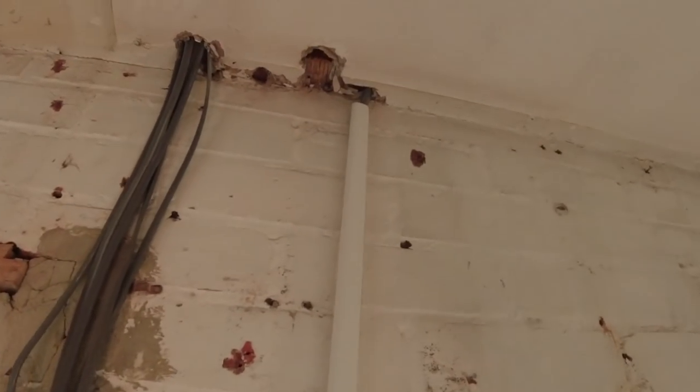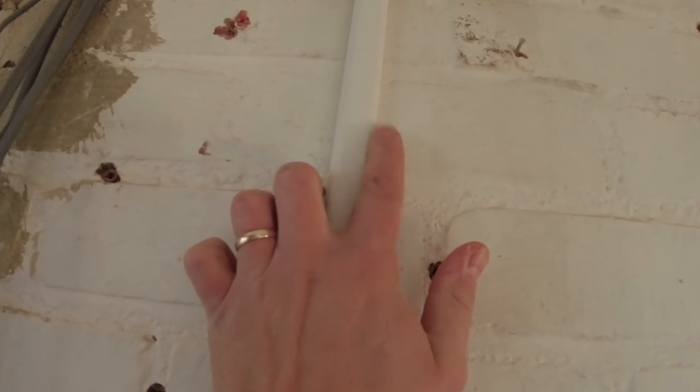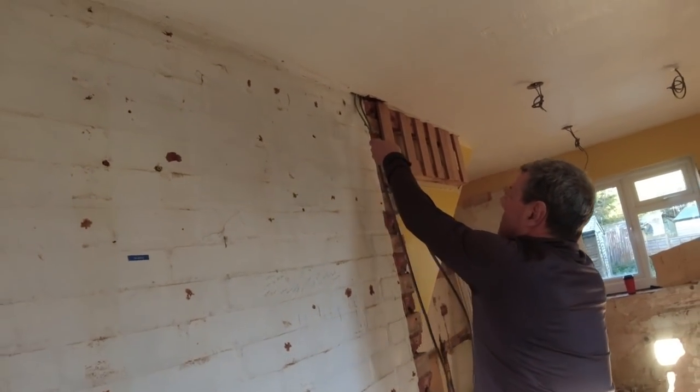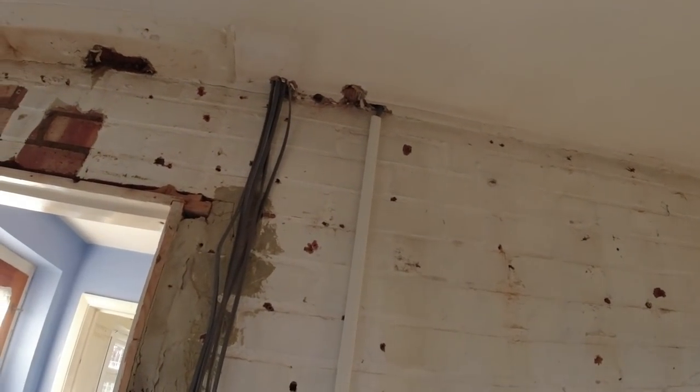So what we're using in here, we're going to be using oval capping. So shove him in the ceiling like that. We'll end up putting a fixing in, a bit of bandy strap, fold it round, and then we'll just bang our boxes on the end. But we're just showing you for demonstration purposes.